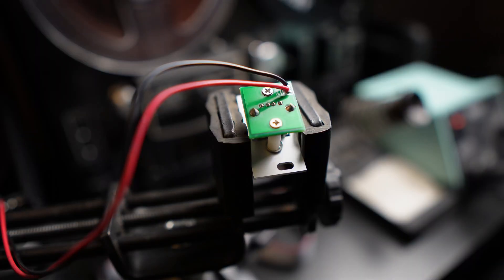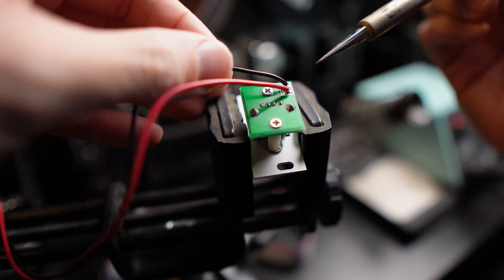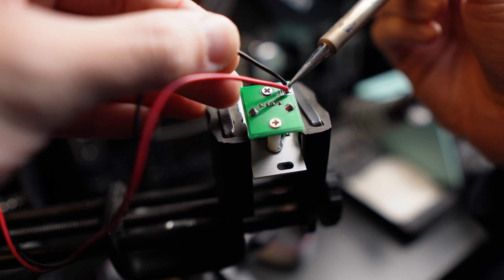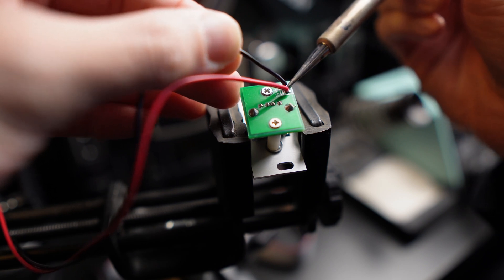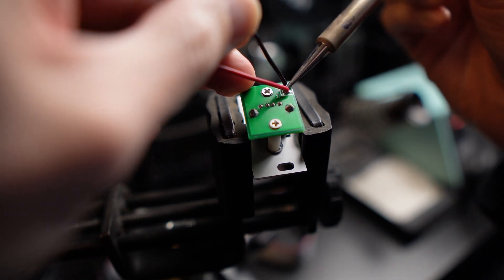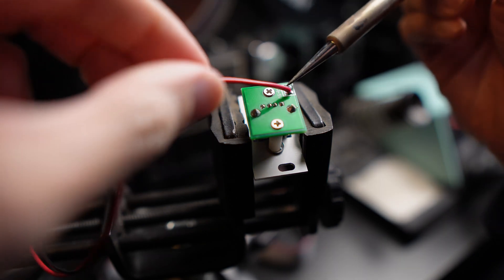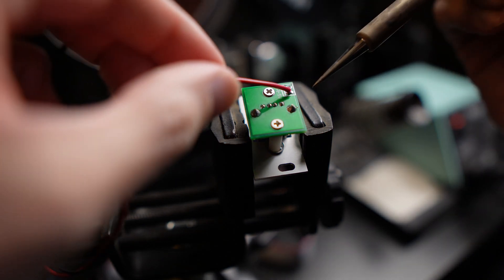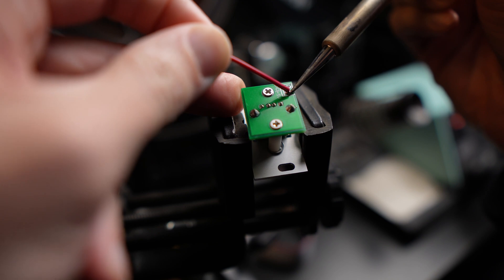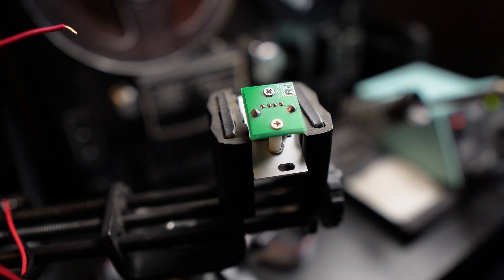I would not recommend you learn how to solder from my channel, but I'm going to show every step of the process just in case this all works out well. I'm just going to heat up what's here right now while providing just a little bit of tension on the other end of the cable — starting with the ground. Of course, this is not plugged in anywhere — that would be very silly. And there we go. That's like a little flat pad. I'll do the same to the other one — heat it up, melt the solder, and the smallest bit of tension. Step one done. Now let's make a cable.